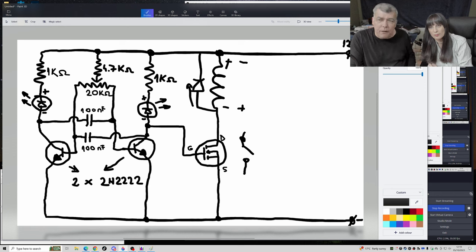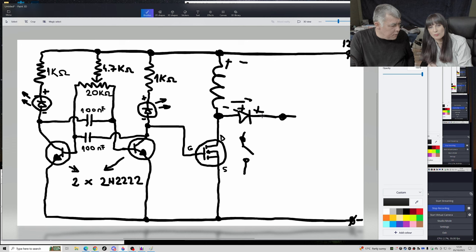What if we don't get rid of the flyback current? The coil gets charged plus/minus, then when the MOSFET cuts the power, we have plus here and minus here. We can use one diode — the current flows in this direction — and we'll have pulses. Then we can use a smoothing capacitor to flatten those pulses.